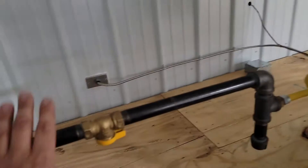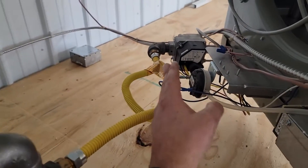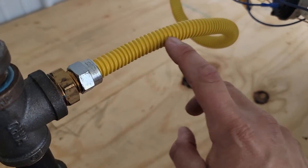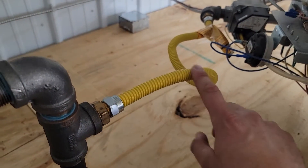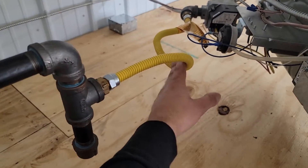Definitely put those comments below so other people have the chance to read and learn from it. What we're going to do is replace this flex hose here because that is our problem area. This right here is three-quarter inch black iron pipe that goes to our hanging heater. In between the three-quarter inch pipe and our gas hookup where the gas valve is, we have got a half-inch hose. The gas flowing through this corrugated pipe will cause the noise, and also gas flowing through an undersized flex hose will cause this.